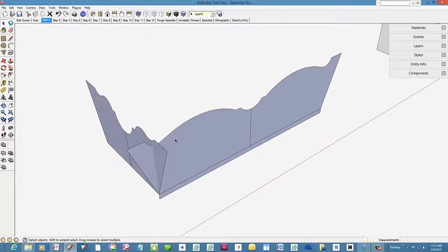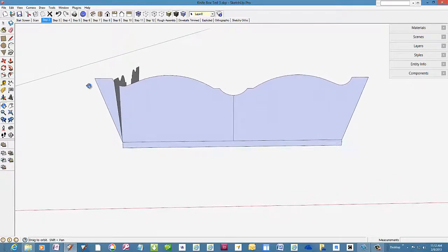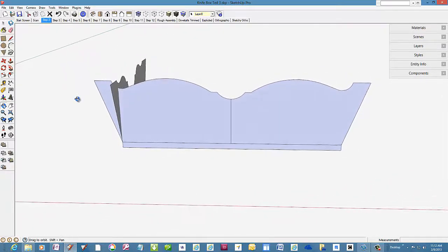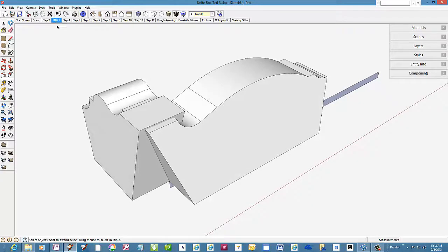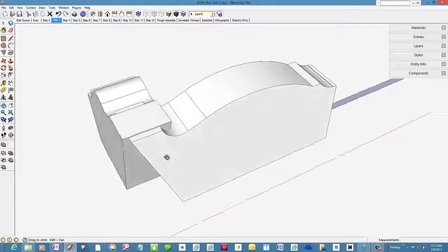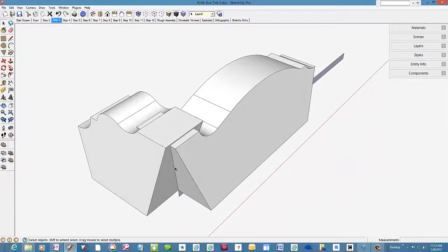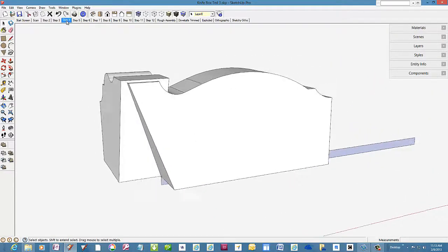With these shapes, we can now begin the layout of the 3D model. The splay complicates the modeling as these shapes are only an orthographic projection of the real size of the components. I can't simply rotate these pieces, rather several extra steps are required. First, I push-pull the faces so that they fully intersect at the box corner shown here. Then I create cutting planes at the splay angle.